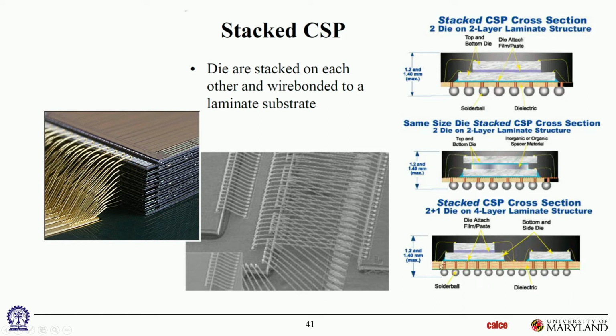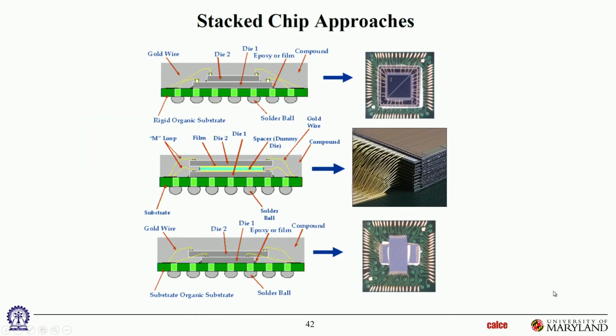And here they are not only going down into the interposer here, they're also talking to another one laterally. So 2 dies stacked over here and one more stacked over here, and they're talking to each other through the interposer. Okay. Oh, sorry. So that's more of similar kinds of pictures. Here is a crossed die approach, by the way. So this cross section really is of this component. So you've got wire bonds from this lower layer coming out over here, wire bonds from the upper layer coming out over there. So you can interconnect to both dies to the substrate.